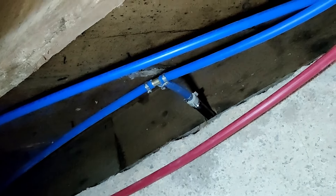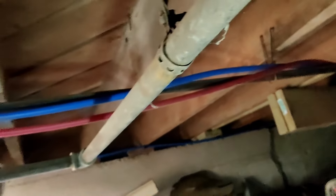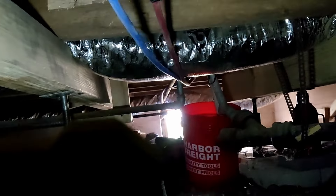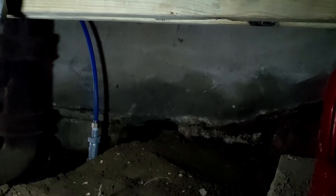Hot and cold come in from the utility room, up along here. There's the spigot — they branch off. The shower hot and cold come in and hit the elbows. Hot water finishes up at the sink; cold water continues under this beam.